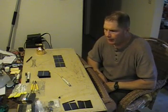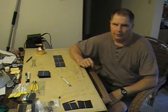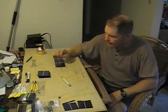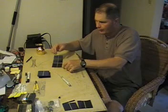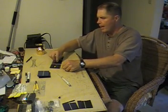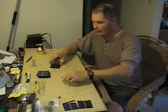I followed directions that said to tin the wire first, then put it on with flux underneath, but I found that put too much solder on and it was a mess. If you need to remove a wire, use the removal tool — slide the wire into it, rotate for grip, heat it with the iron, and pull up on the wire while running the iron backward. Take your time; don't apply pressure or you'll snap the cell.